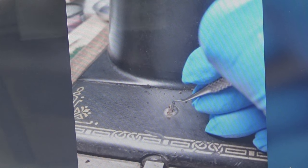And you never want to try to put a screwdriver into a screw if it's all crudded up, because in all likelihood, you're going to be forcing that screwdriver in and it's either going to skip off and cause damage to the bed, or it's going to skip off and crack the screw, and then you'll have to drill it out. So taking a little bit of time to clean that groove out to get a nice clear track to put that screwdriver into is well worth the time.